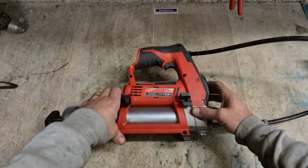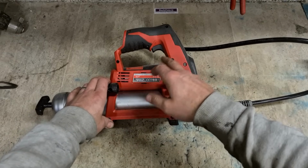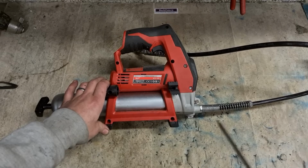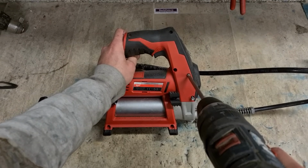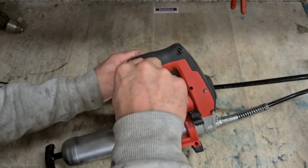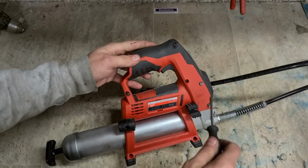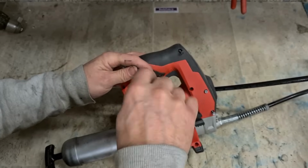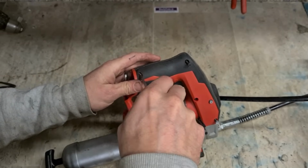Right, more than likely this is water damage that's done this. I think this is on a boat, so the salt water may have corroded the board or something. So I'll get her cracked open, I'll see if we can get her fixed up. Milwaukee like their screws anyway. 3 different types of screws on the front of one machine. T20s here, T15s and T10s. Just to make things that little bit more awkward.